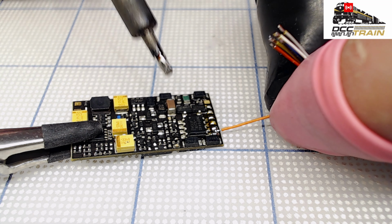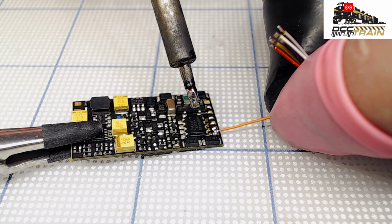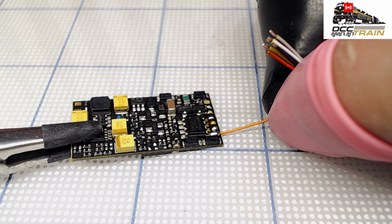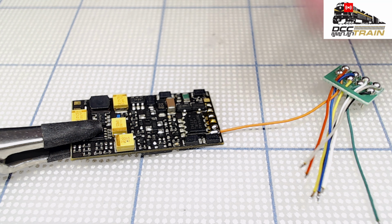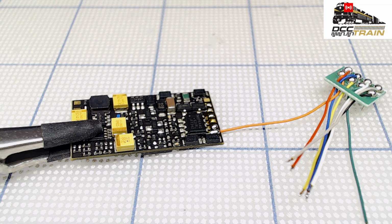Okay, putting that wire in. I need to hold it a little bit longer because that element has a leg, and it will take a lot of heat. So like that. Perfect. It's shiny, which is the temperature indicator that the temperature is fine. It's not getting kind of grainy, you know, like a flat surface. That's exactly what I need.